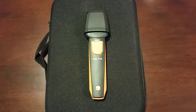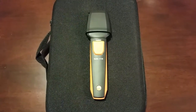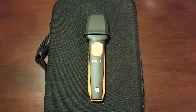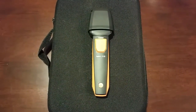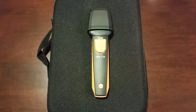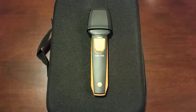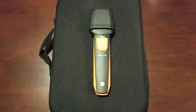After posting it, I got some information from a couple guys that were concerned that the free area I was using in the calculation was incorrect. After doing some research and a little bit of help from Joe Shearer, we were able to determine that in fact I was using the incorrect free space. This particular 20 by 25 grill has about 69 to 70% free space.